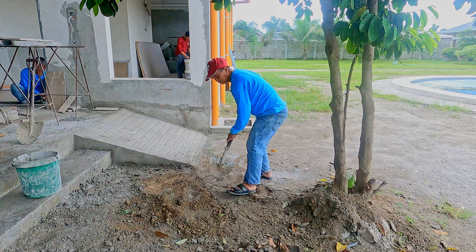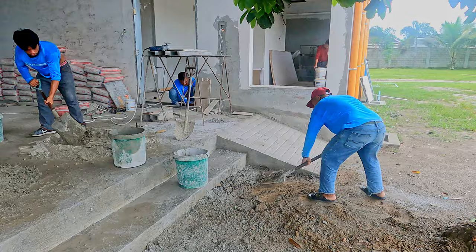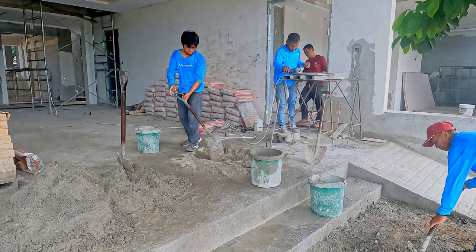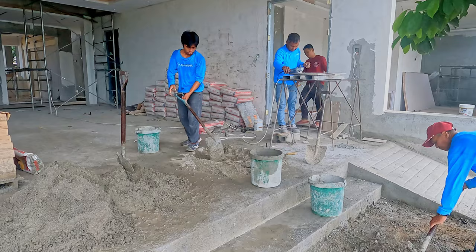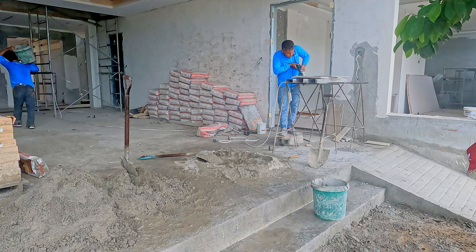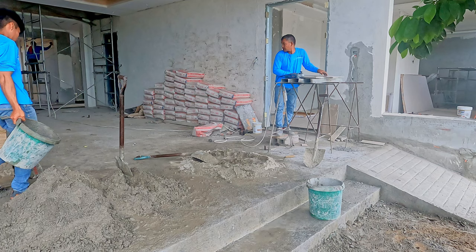Every day, site cleanup goes on. Coelito is cleaning out some of the rubble and building detritus that's formed over here. This is where they're continuing to mix up tile adhesive, dry pack, and other cement-related compounds. It does remain one area where they have not put down a wooden frame underneath, so they've got to be fairly quick — once they mix here, they have to clean it up quickly. Otherwise, you get a build-up of material on the floor that, as it sets, gives them a very hard time to remove.